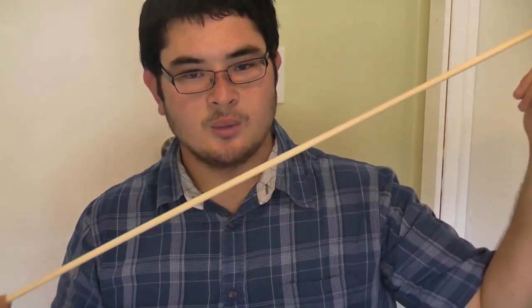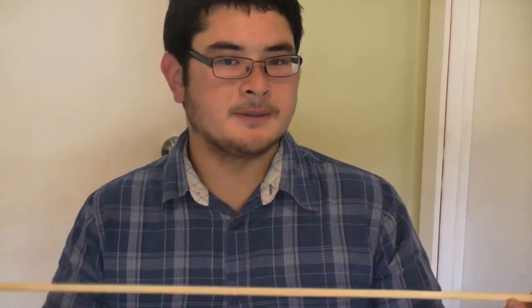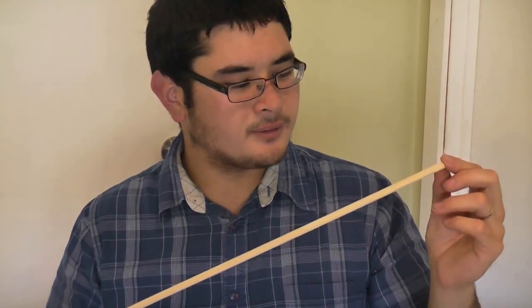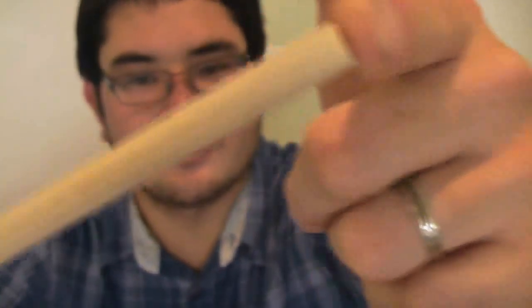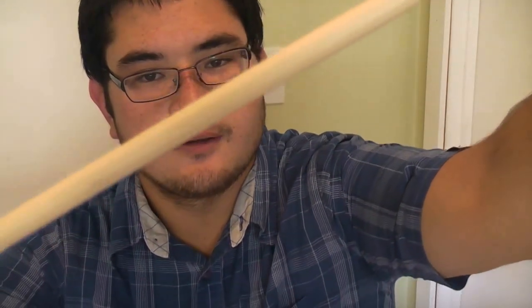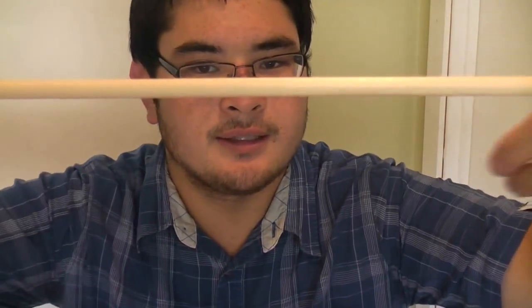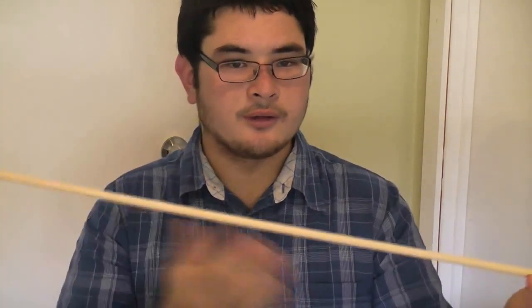What you're going to need is a wooden dowel. Just go down to the hardware store and pick up a wooden dowel. You want to get a hardwood dowel — either birch, ramin, or poplar all work really well. This right here is a poplar dowel. The most important thing is that the grain runs straight from one side to the other. You don't want any knots, you don't want any wavy grain, you don't want any runoffs, because those are all places where the arrow could break when you use it.